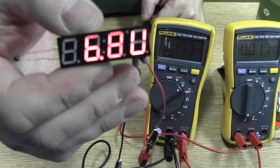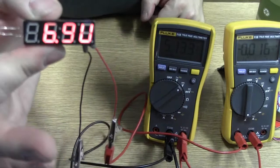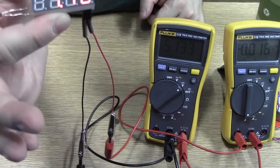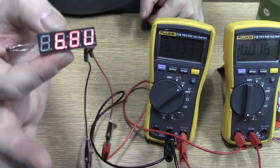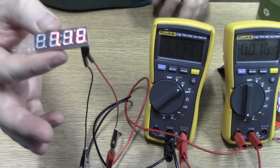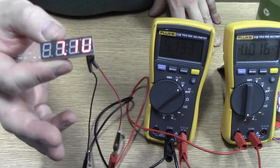It's the minimum range. But you would have thought if you are under voltage, if you are below the voltage range, you would come up with something other than 7 volts, because that can be quite deceiving. You might think that you're powering it with 7 volts when you've got it plugged in, and you're not, you're actually powering it with 5. So yeah, that's a fail in my book, and a very bad one. That should read something like OL, over range or under range, or UL, UR, OR, OL, your standard multimeter readings, or at least show 0, stating that it's an unmeasurable value.